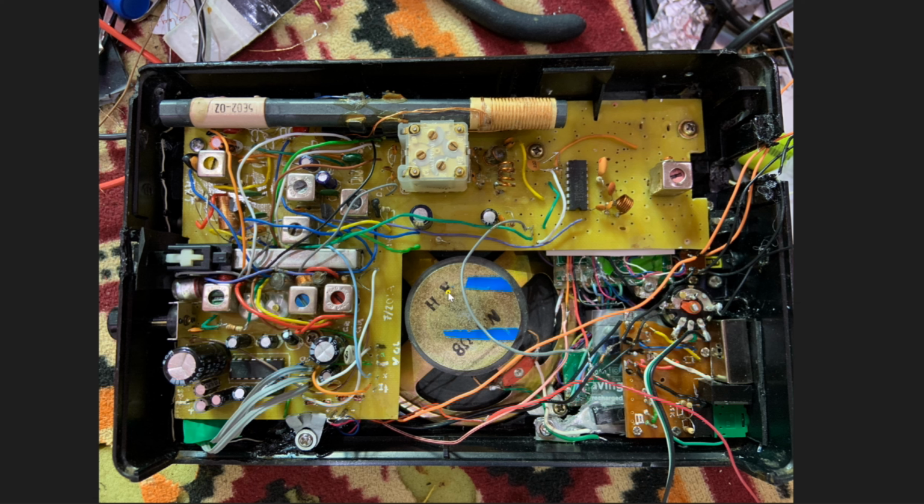Still, I will stick to lithium ion batteries here to serve as internal battery, and I will connect them from this side to a charging unit. So the power management unit here would actually switch between the internal dry cells, the internal rechargeable lithium ion batteries, and the power bank, because I will actually provide a circuit for a power bank. That's why when you take this radio outside for the camping safari, it's going to be very convenient. It will have infinite time of power, will never discharge, it will take so much time. Also, I will provide some light here in case you need it at night.